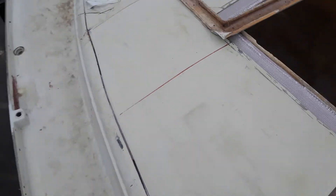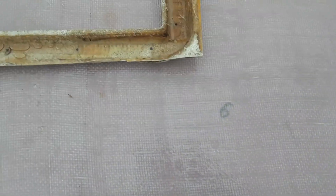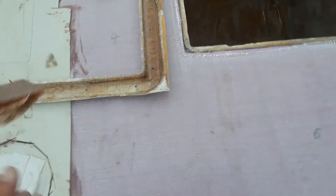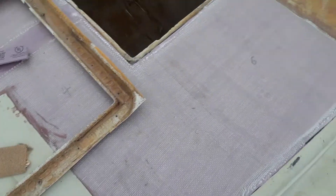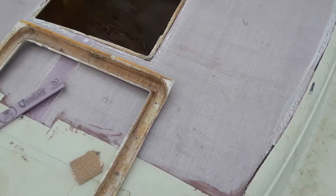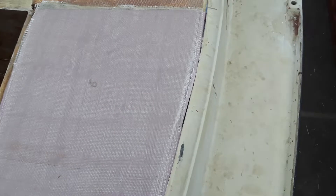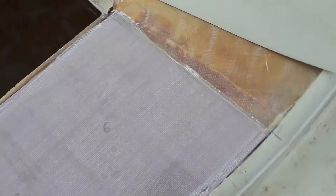I would have adhered them yesterday — they fit right in — but everything was kicking in the 92-degree heat, the epoxy was going crazy. I started at 6 a.m. From 6 to 10 it was beautiful, but 10 to 12:30 was brutal. The epoxy was kicking off in like five minutes, so I had to spread it fast through little batches.